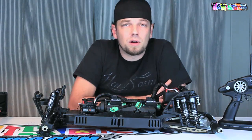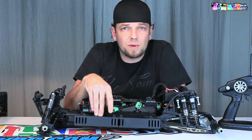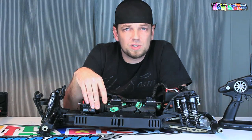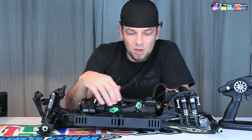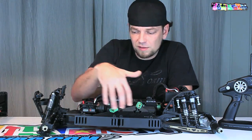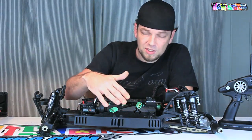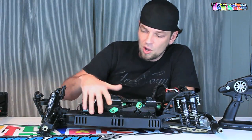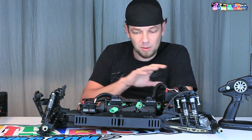The batteries I will run in this car are Dyna G batteries — 6500 milliamp-hours from the top of my head, with a 65C rating, 11.1 volts, all of them. I will be able to fit two on this side of the car and two on the other side. The batteries on this side will be powering the front, and the batteries on the right side of the car will be powering the rear.